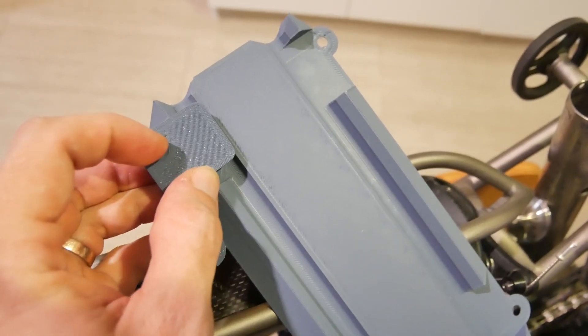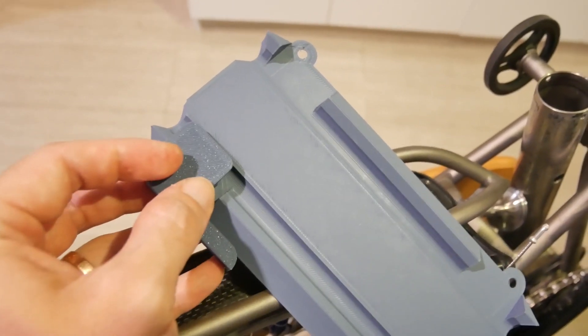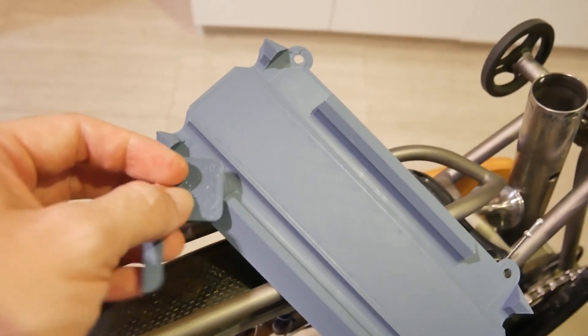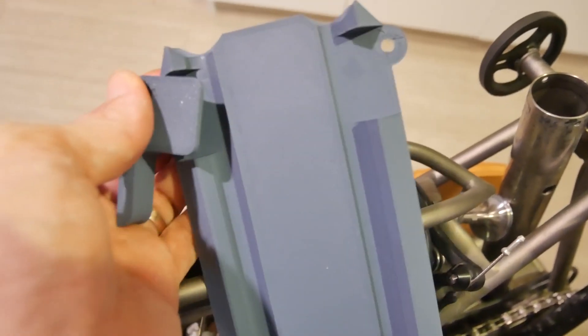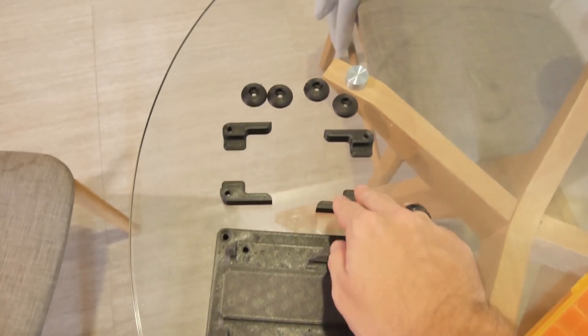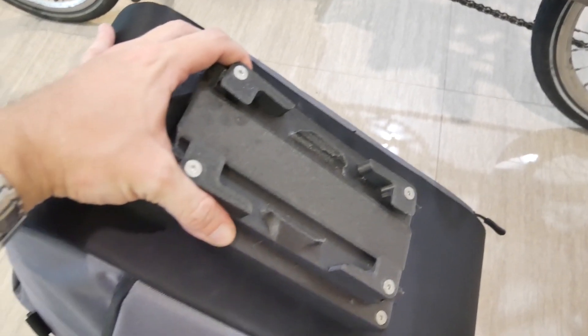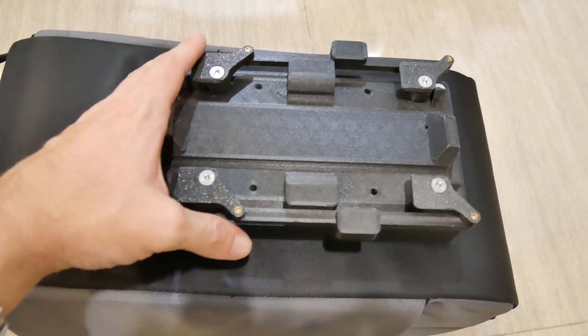I think I'll have to redesign the cam a little bit. The axis of rotation should be as close as possible to the rail it's trying to lock onto, so there's as small a torque moment as possible flexing it outward - we don't want that happening. We've got our main block, four cams, and four little washer pieces to go on the inside. There she is, bolted securely to the underside of the bag - it's looking great. I've got dome standoffs inside to ensure the bolts aren't jabbing up into the bottom of anything placed in the bag.